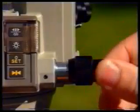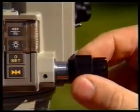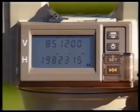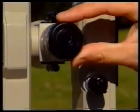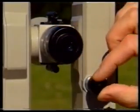When it is tightened, however, the telescope can only be rotated about its vertical axis by small amounts using the horizontal circle slow motion screw, which is also known as its tangent screw. This causes corresponding small changes in the horizontal circle readings. Similarly, in order to enable the telescope to be rotated about its trunnion axis, a vertical clamp and slow motion screw are fitted.